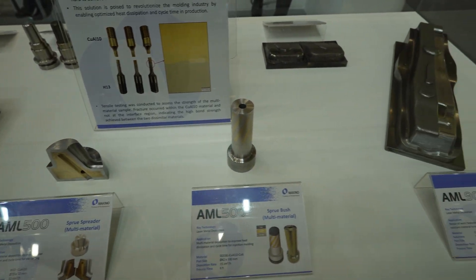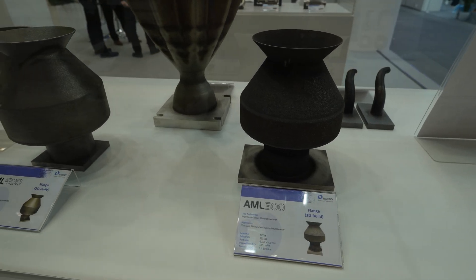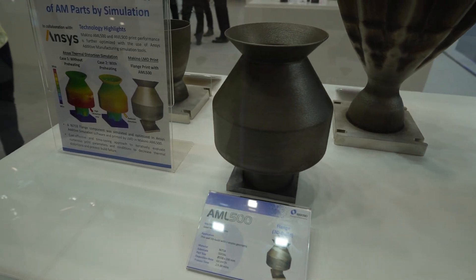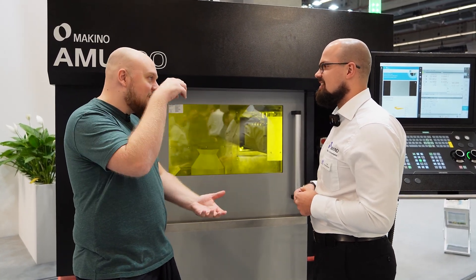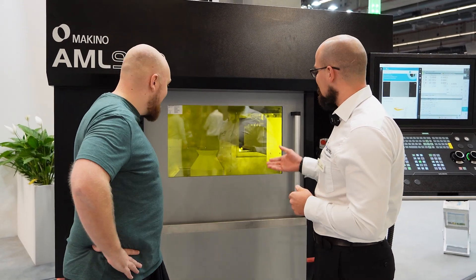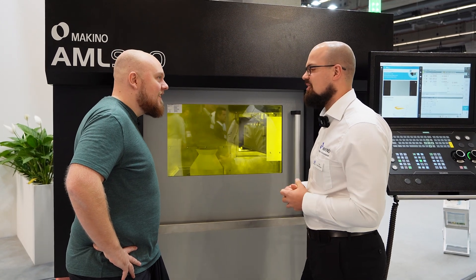What's happening here is we have a laser coming vertically downwards and powder getting blown out of the nozzle in a cone shape, focused into the laser spot. So instead of filament that's getting molten through the nozzle, you're adding it on the side and the laser is just slamming it on the previous layer. Exactly, then we move around and out come these big volume parts that we can print on our machine.